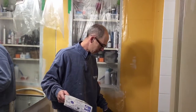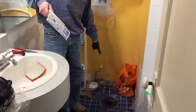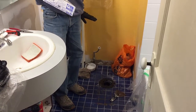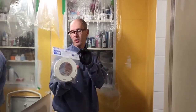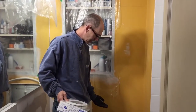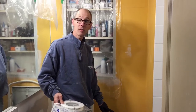We've just recently pulled out the toilet and I'm going to clean up the closet flange and make sure the area is very level so when we put the toilet on it, it doesn't move around. I'm also going to install this closet flange extender, which will bring up the level a little bit because we're going to be putting flooring down — about 5/16 of an inch.